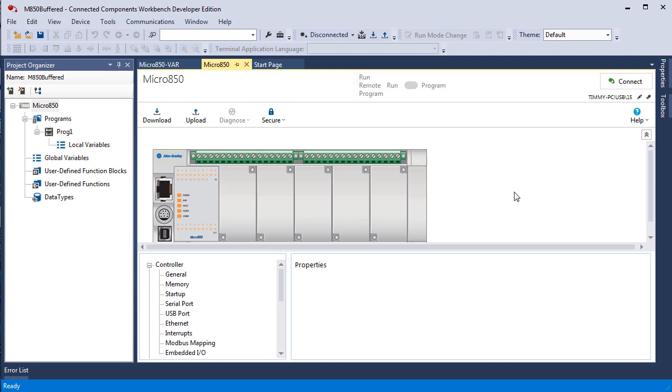The LC50 QBB is a really nice controller, probably my favorite out of this family, and I do own all of them except the LC30, which I've explained before. I don't see an effective way to put Ethernet on an LC30. The LC20 with the remote LCD screen is probably the most bang for the buck unless you need multiple axes of PTO for motion, or some of the other features you're going to find in the 50 or the 70.